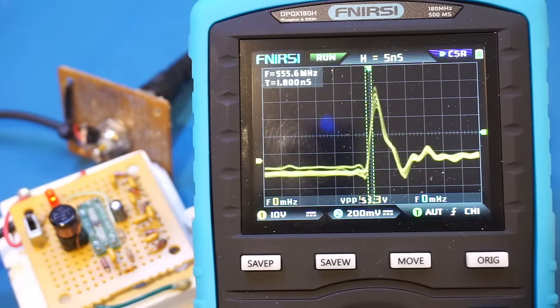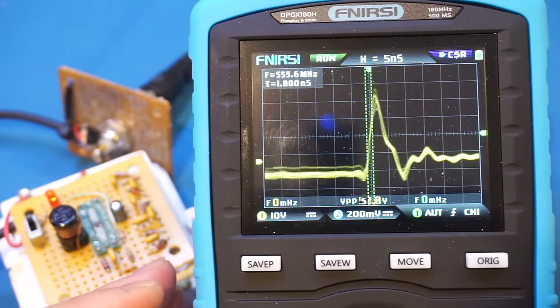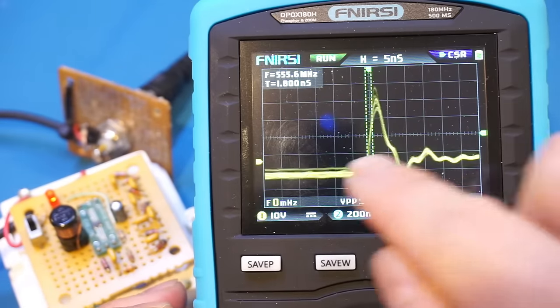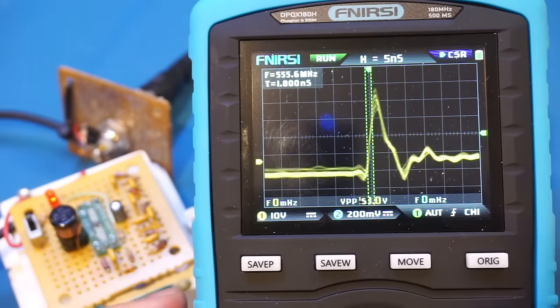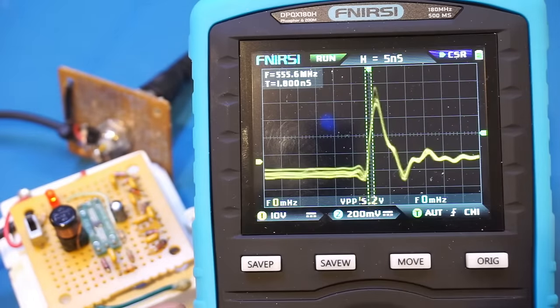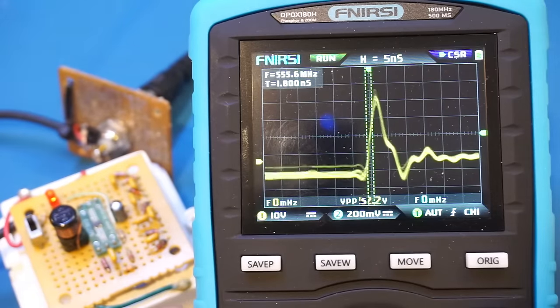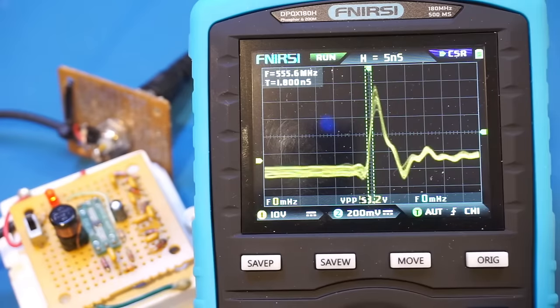Okay, I had to refer to the manual. The problem of the cursor measurement is it's actually a little bit convoluted. Once it's enabled, you have to use the auto key to switch between the left and right cursor and to move them accordingly. The problem of that is sometimes if you're out of the measurement mode for whatever reason, you press auto and the signal is being reacquired. And it took quite a bit of trial and error to eventually get to this point.